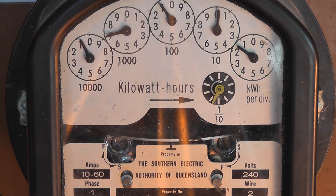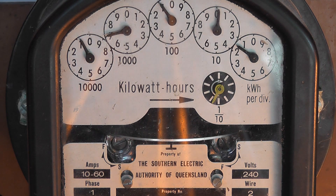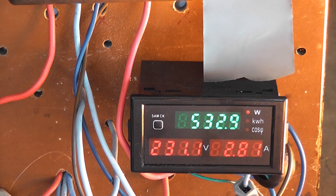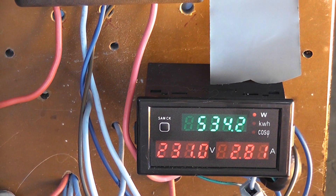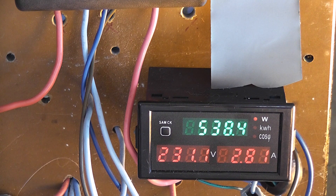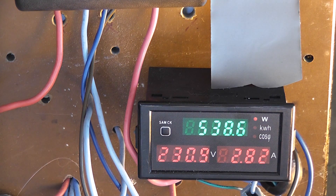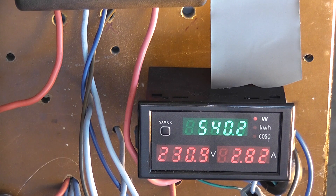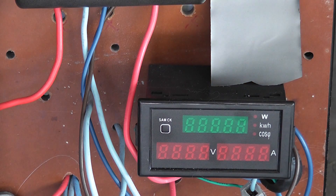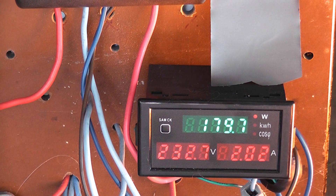All the lamps are connected up. The loading is about 530 watts, 231 volts, 2.81 ampere. I'm going to turn them off and then let them strike, and you'll see the start currents and how it fluctuates. De-energizing the devices — the meter will go off. De-energize: 540 watts, click. I won't give them a full cool down — I'll switch them back on again. Some bulbs are hot and they don't strike at the same time, so the cycles are not too bad: 380 watts.